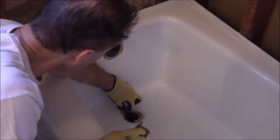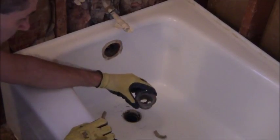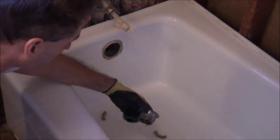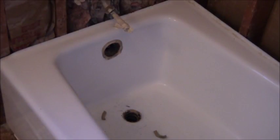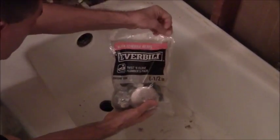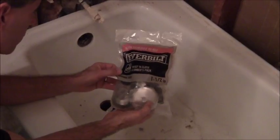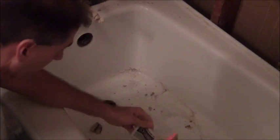What I'm going to do is take and clean off this area, clean off this plumber's putty, get a new one of these, get some new plumber's putty, put that on, and then put this all together — make sure it's nice and a good tight seal. Just going to make sure that the thread pattern matches up exactly with the one that I buy. I got this package here at the Home Depot: Black Schedule 40 ABS Twist and Close Plumber's Pack Chrome Trim, one and a half inch. It should work perfectly good.